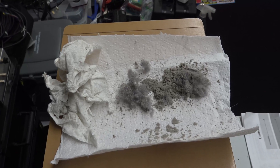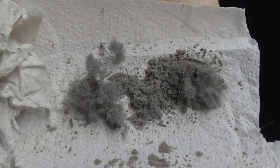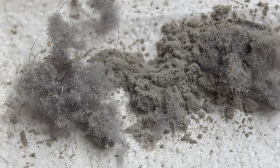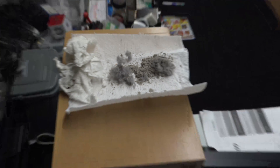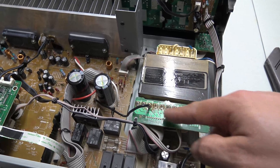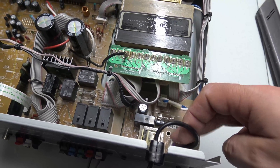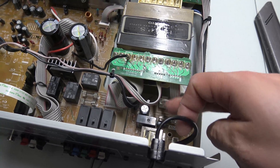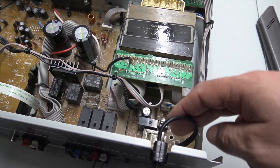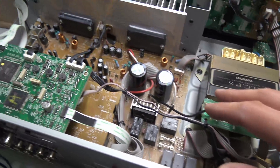There it is — that, my good friends, was in there. John, my dear friend, this is probably quite a lot of you and your family's skin — what a lovely thought! So there's a massive transformer here: mains comes in this side, various windings on this side, mains distribution, a little bit of spark arrest and surge arrest going on, and that clearly runs power supply out to all the rest of the PCBs.